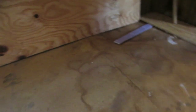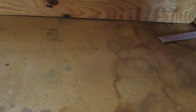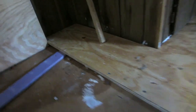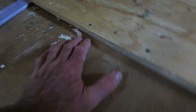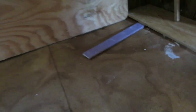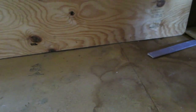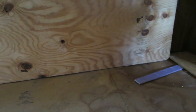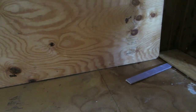And these things can be cut simply using a handsaw, and it's going to be messy, but it also compresses a bit. So the low spots are in between the joists. I'm going to put a piece in the middle. I have screws. I've put screws to make level, so it's level. Basically going to end up being level with the top of the joist. And I'm going to cut me some sections and lay them in there. And theoretically, that'll take up the gaps, give it some support, and it should feel pretty solid at that point.